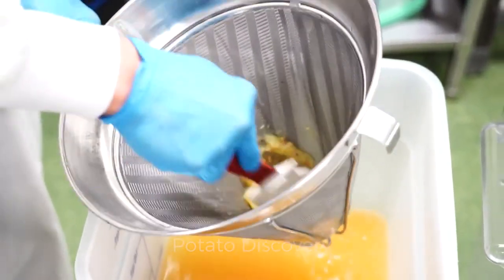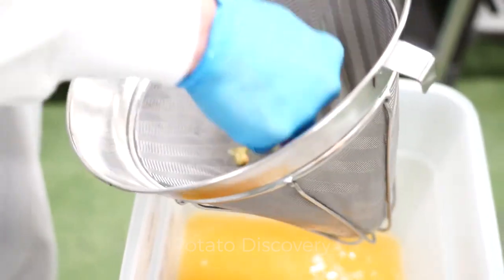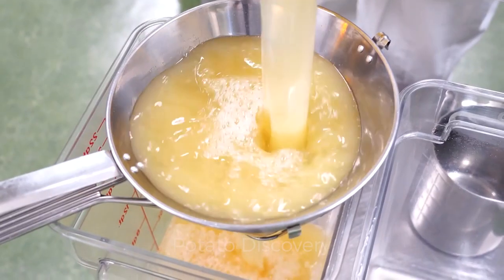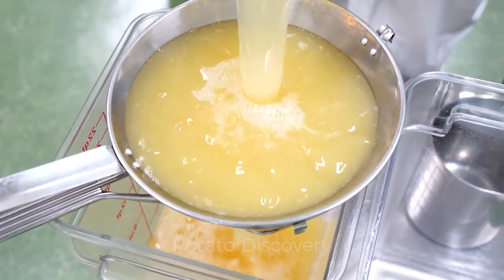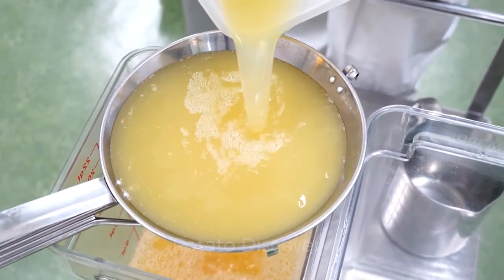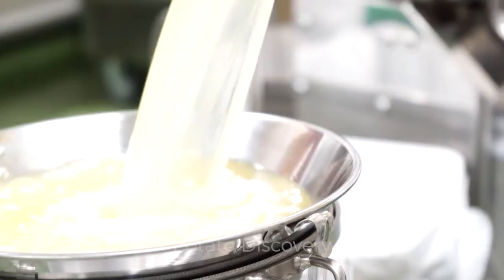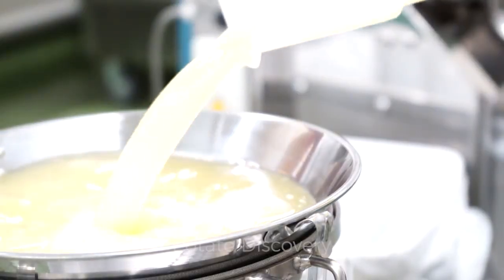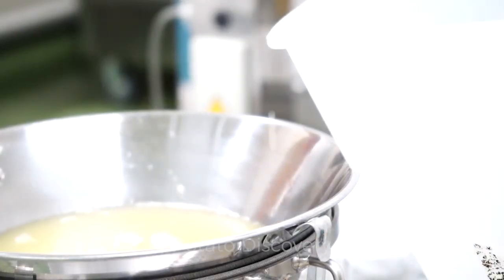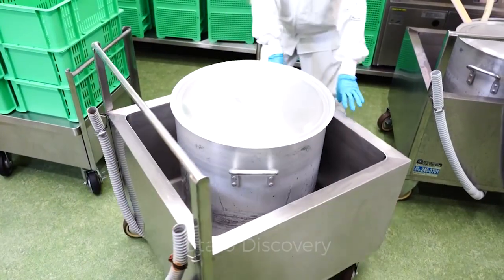Raw juice is fed into the settling vats by gravity or is pumped. It is worth remembering that if electricity is unreliable, a manual and/or mechanical juice pump is essential. The valve through which settled juice is drawn off should be as near to the bottom of the vat as is practicable, in order that settled juice is not wasted.